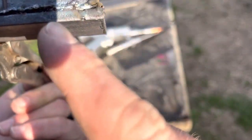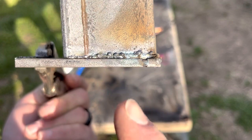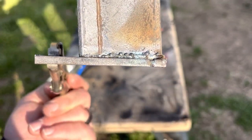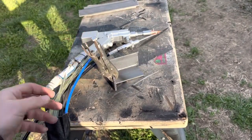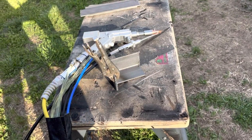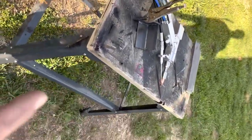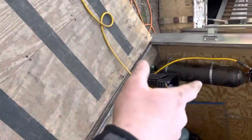You can see on this side there, we started to get some of that weld material all the way down. That's why it took a little while for it to want to start pushing itself. Another good thing to note when you actually switch to welding — that I don't think I covered in the other video — was instead of using compressed air, you'll actually use nitrogen.